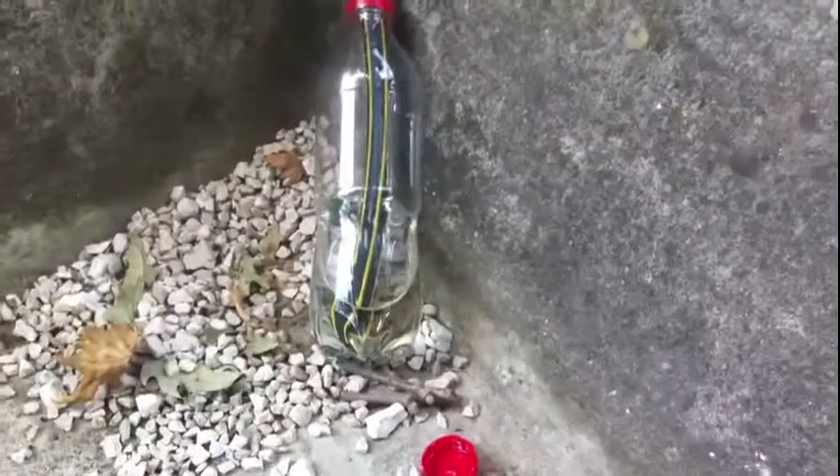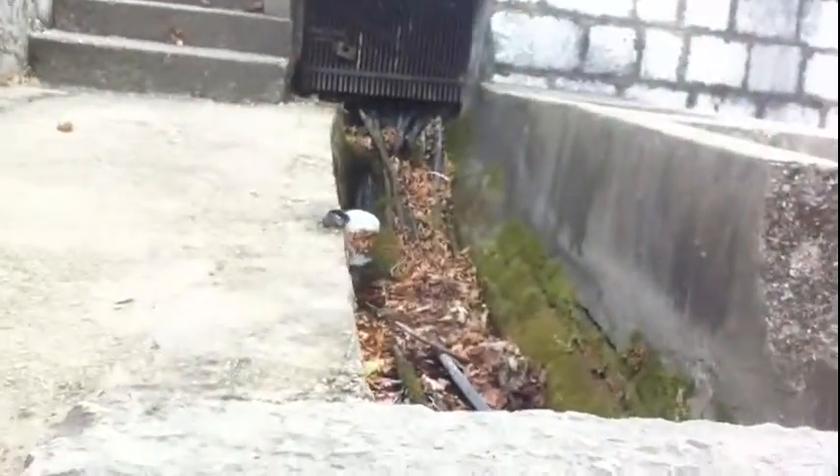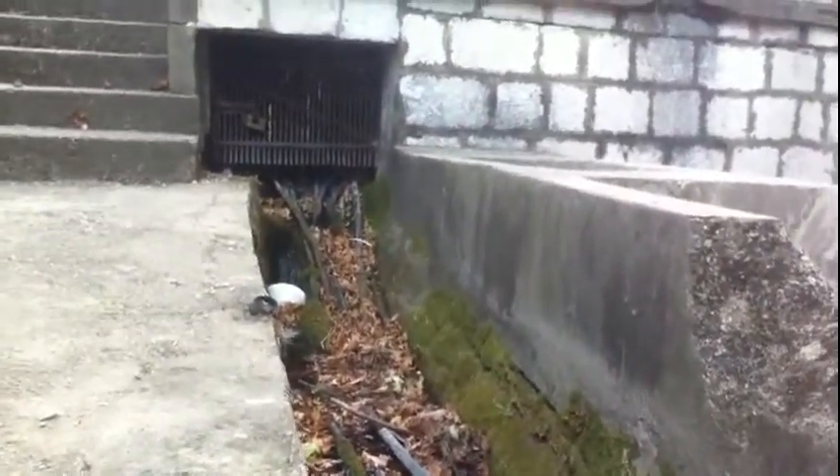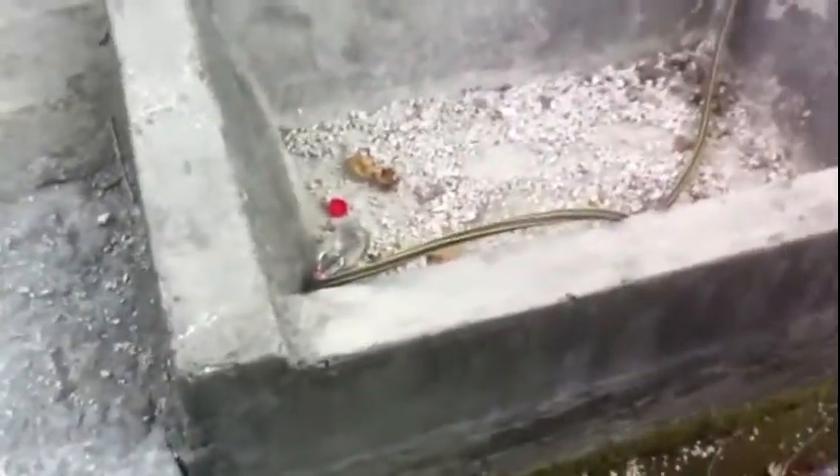I don't get this negative pressure which lets the valve open up. Just to show you — when I do it manually, I get some water up here, which is very nice. This is probably half a liter. Just by clicking it 10 times I get probably 300 milliliters, which is very nice. This is also already higher than where it started — probably half a meter, maybe a little less, 40 centimeters. So I do get the water higher. Everything works fine, I just don't get the valve to self-operate.